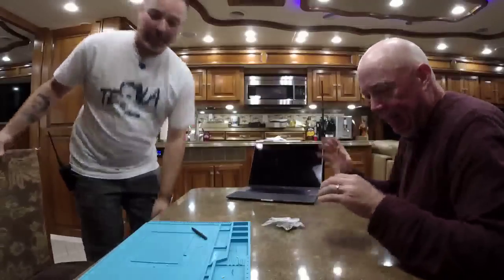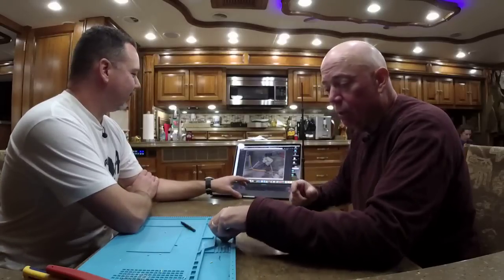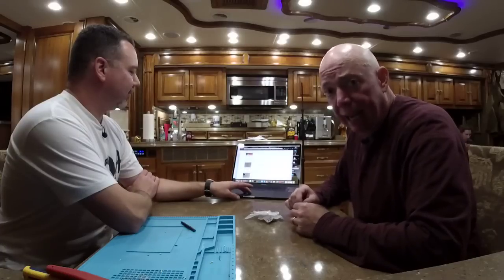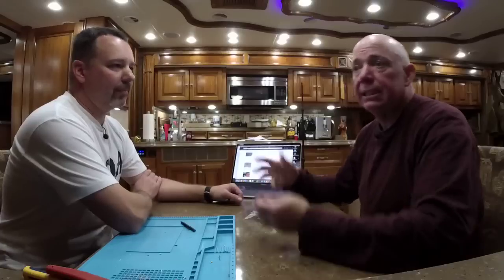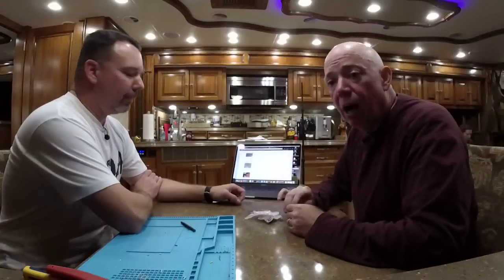And just to follow up on all this, this was to show you a home programmable thermostat, a smart thermostat in this case, because we're using Z-Wave technology, and there's a reason for that. We chose this because of our motor coaches and the software we have running in them. But even though this is Z-Wave and you might not use Z-Wave at all, it doesn't matter. It's a programmable thermostat, and that's all you really need to know, because you can set it based on day and time. So you can say at 8 p.m., cool the coach down to 68 degrees for sleeping, or whatever your chosen value is. And you can do that for each zone.